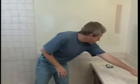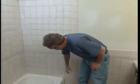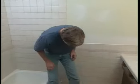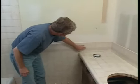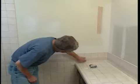One thing we want to do is have all the horizontal grout lines tie in around the entire room. The other thing we want to accomplish is the cut tiles between the wall and the tub, this row of tiles here, the cut tiles between this wall here and the floor, this row, and our cut tiles right above the countertop. We want those to be as wide as possible. Now, the ones above the tub and down here are between 2 and 3 inches, which is fine. This one gets to be a little narrow. It still looks all right.